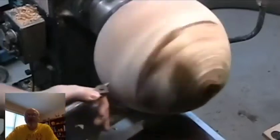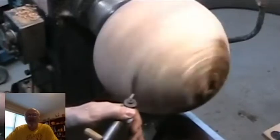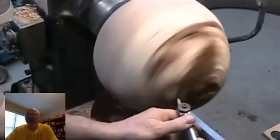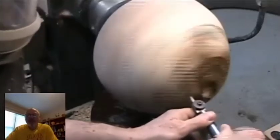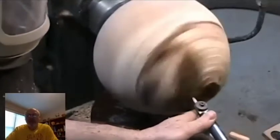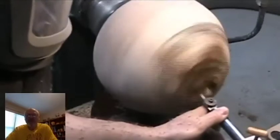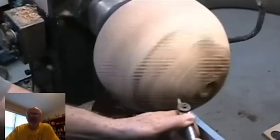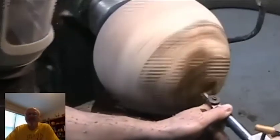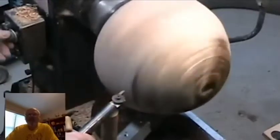It's starting to cut — this means the area near the middle of the sphere has a smaller diameter than near the end, so I have to work on the ends first to get it round. You want to be very gentle with this. The secondary rest is required because this piece is not as stiff as commercial brands, so you really need the two tool rests or else you can get some very severe catching. I'm turning the speed up a little bit.